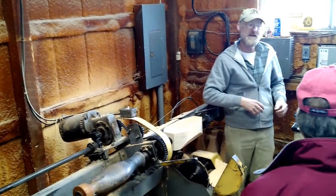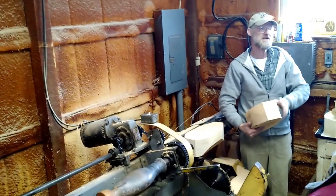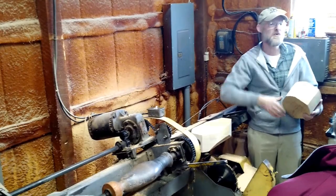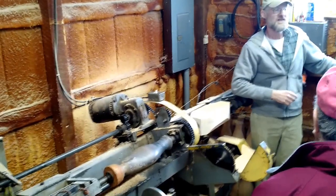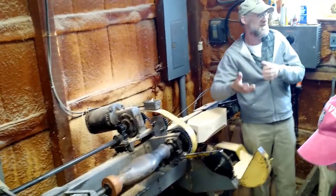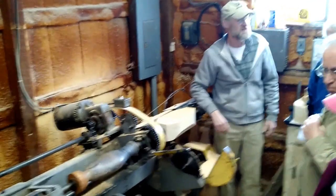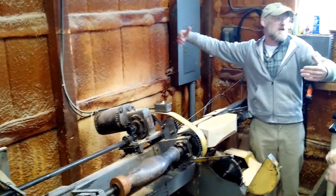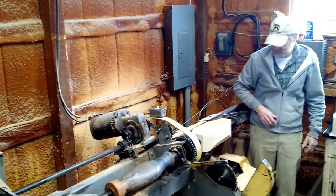Actually a direction. Never thought about that. Also, when I put it in the machine, I try to put the heart in the top of the block so it sands smoother, since the outside tends to be more wavy. Do you mark them, then, if you have a quarter sawn one that's not to be the floating decoy? Actually, there's a note on birds right there that says these are for gunning birds if I need them. I can use them the other way, but yes, I do mark them. Perfect. Because you don't get as many slab sawn ones when you're sawing out a great big log. You may not get all of them, depending on what the best utilization of the block of wood is.